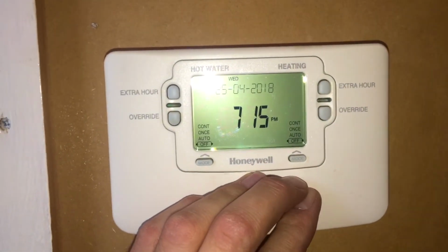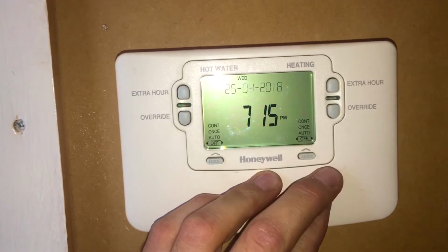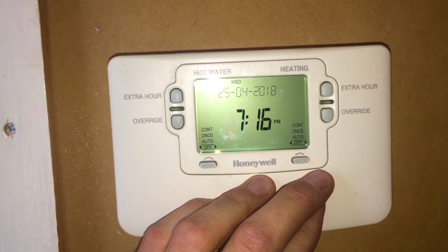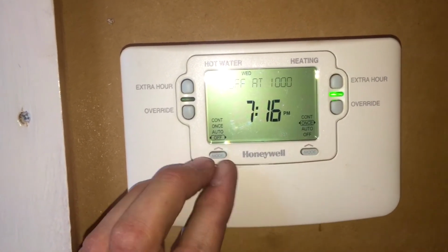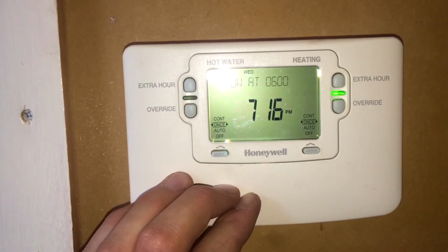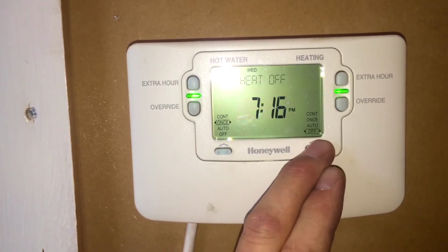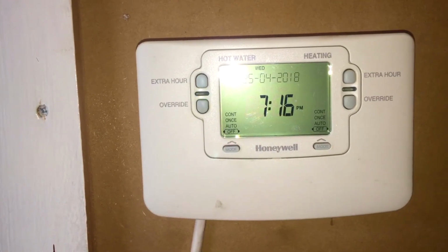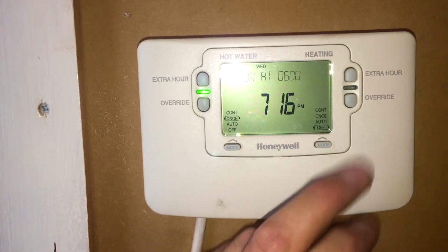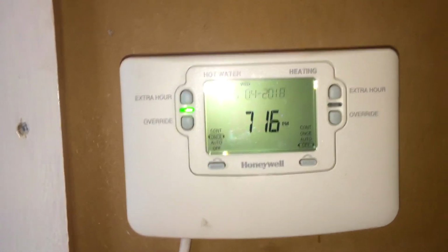So if you listen carefully here, I'll put the heating on, you'll hear one click. I'll put the hot water on, you won't hear a click at all. And when I turn the heating off, you'll hear two clicks, almost simultaneous, almost together. So here we go. Nice strong click. Nothing practically. Now when I turn this off, you'll hear two clicks. I hope you heard. Du-duk. Ooh, tiny click there, that might have worked that time, but that's a good way to tell anyway.